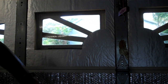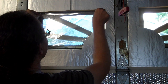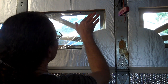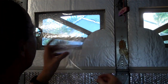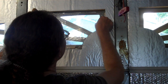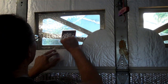The general instructions are: make sure there's a lot of water with maybe a little dish soap, line it up, get one edge lined up nicely because once it starts going in it's hard to rotate without a whole bunch of water in there. Then take the protective plastic and put it on top so you don't scrape the film with your scraper — it doesn't have to be perfectly lined up, just so the majority is covered. I like working from the middle out.